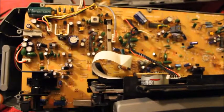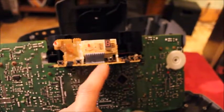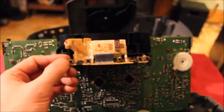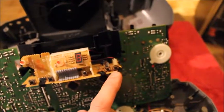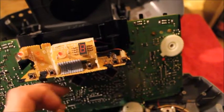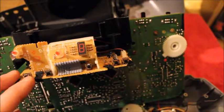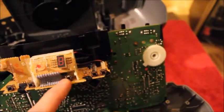We have it apart here. What you're looking at are the actual buttons from the front — the play button here, the stop button over here, and the repeat button. There's some rust on these buttons too, which tells me it was kept in a basement somewhere with a lot of moisture. The play button — someone was probably pressing it too hard over time — it has no click to it at all. These other buttons have a soft switch feel to them. That's where we found our problem.